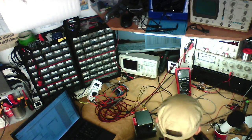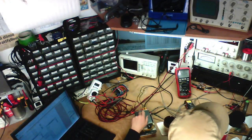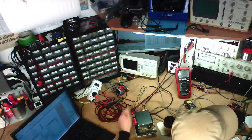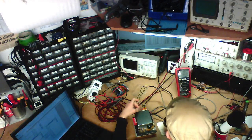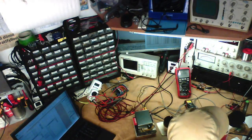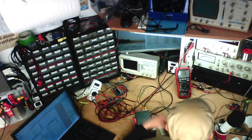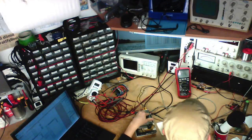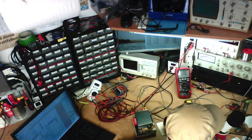No, Twin Famicom, it's sitting on a heap of just normal CD cases for a reason, and that's because I've got these. You're not going to be able to see them because of this shit resolution, but I've got little needle probes sticking out up and down from the amplifier, which is going to this box. I've just soldered needles onto the end of these cables to be able to shove them into really tight little speaker outputs together with the leads for the dummy load. There's no point probing the amplifier from the dummy load. I have to probe just at the amplifier output, else I'm going to have all this crap coming into the wires to account for as well, and it's just going to give shit results.